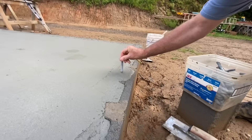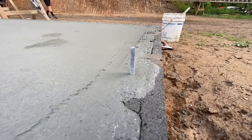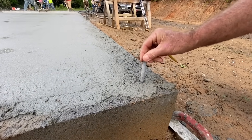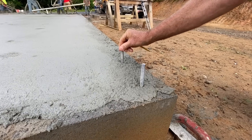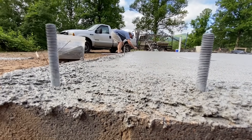Harlow and I went around and set all the anchor bolts that would hold down the exterior walls to the foundation. These are 8-inch by half-inch galvanized bolts. You have to let them stick up about two inches so they'll go through an inch-and-a-half plate and still have room for the nut to catch on the threads on top. We put them about four feet on center and one at the end of each plate.